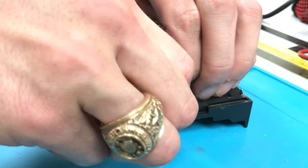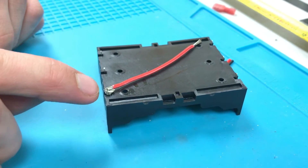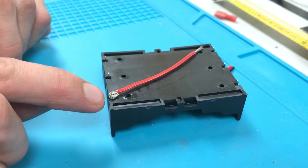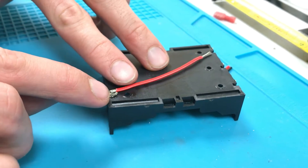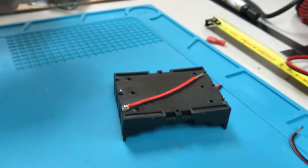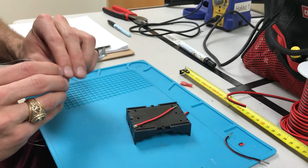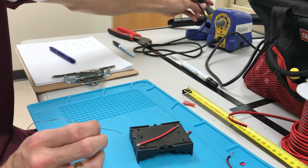Try to pinch that so you have a clean location — you don't want metal spread out everywhere, you want it concentrated right where you want the solder to flow. Then you can heat up that region with your iron, get the solder to flow in there, and then get out of there so you don't melt any plastic.